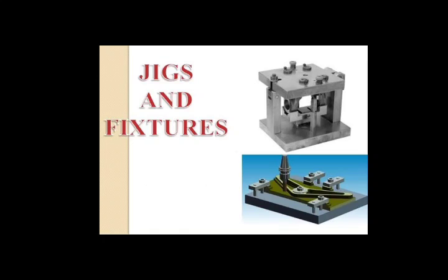High tensile steel is the next category, which can be grouped in two categories: medium carbon steel with 0.45 to 0.65% carbon and alloy steels, that is En24. And high tensile steel can be hardened up to Rc40. Mild steel is the most widely used material as the carbon percentage in mild steel is less than 0.3%. In case of light duty application, the use of mild steel is preferred as its cost is very low.